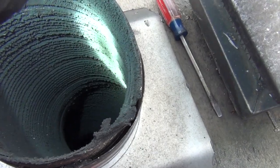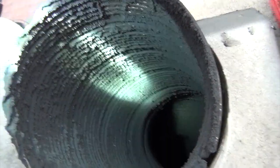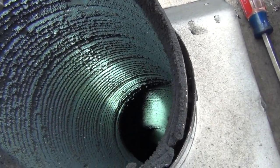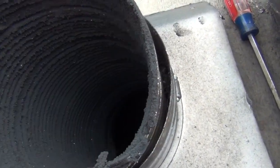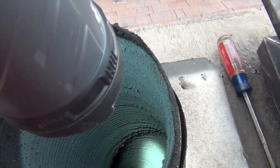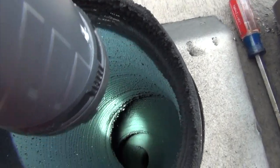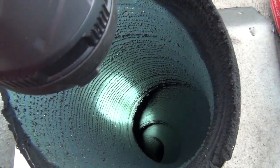And it's not good for your stove if you build up a quarter inch. This is a sixteenth of an inch of fly ash. You don't have to worry about that. You need to clean it at the end of the year, because it will ultimately restrict your draft a bit. But there's no danger here for a chimney fire — zero.